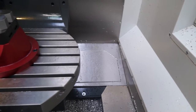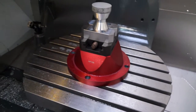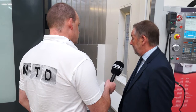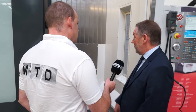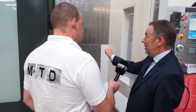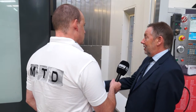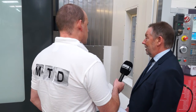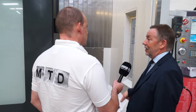The table itself is not square and it's not round. It's 600mm across one side to the other and 500mm across the two flats. It has continuous rotation of the centre section and will go plus 110 degrees up to minus 35 degrees the other way. That's no restriction because if you want it to go up further you simply rotate the middle axis.